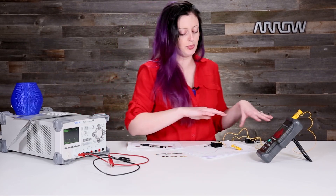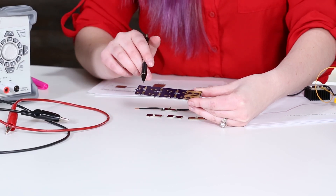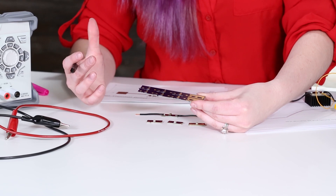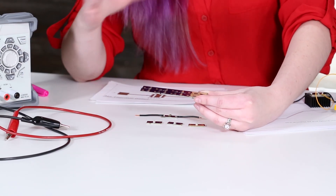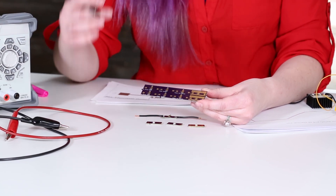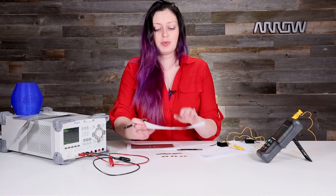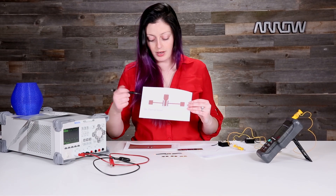I have these little boards made up and they started like this. I've got four different ways that people might be doing thermals on an LED. On each one of these, I'm using a Cree XPE LED — one of their X lamps, very common. Running one amp on them is perfectly acceptable, so we're going to be testing both at half an amp and one amp. On each of these, I've put the LED right in the middle and given myself a power and ground pad as well as a thermal pad. These are pretty hard to see, so I printed out the actual layout for each. This is what I would consider a rookie mistake at PCB layout — you made your pads, you made the LED, forget about the thermal, and you just connect it over with the default traces. There is no thermal relief on this LED. And remember, if these are 3-volt, 3.3-volt LEDs running at one amp, we're talking three watts.